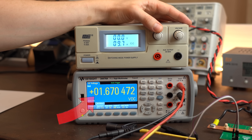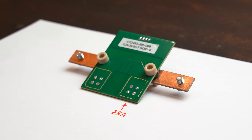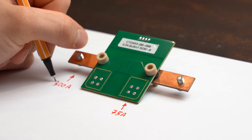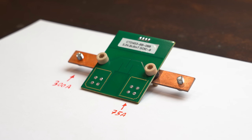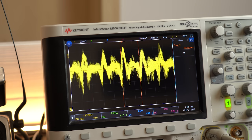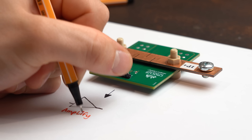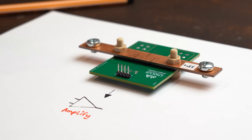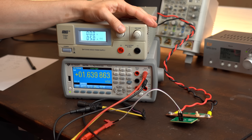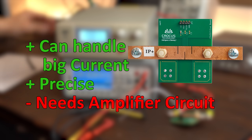Keep in mind that the voltage change is pretty small when measuring smaller currents, because this thing can handle 75A or even 300A with its bus bar. So when measuring a small fluctuating current you always have to look out for noise and preferably come up with a low-noise amplifier circuit. Other than that, the IC does its job as intended and I was very happy to learn about this method of measuring current.